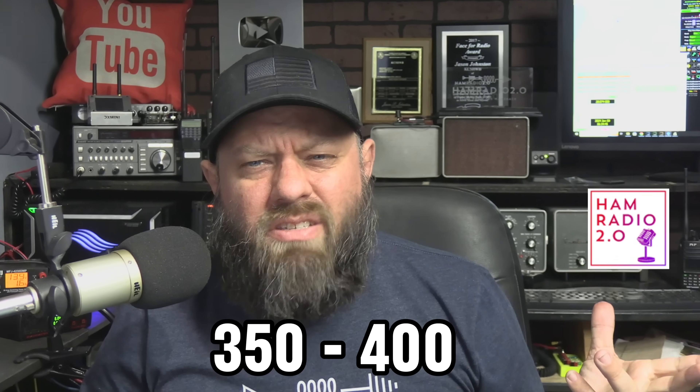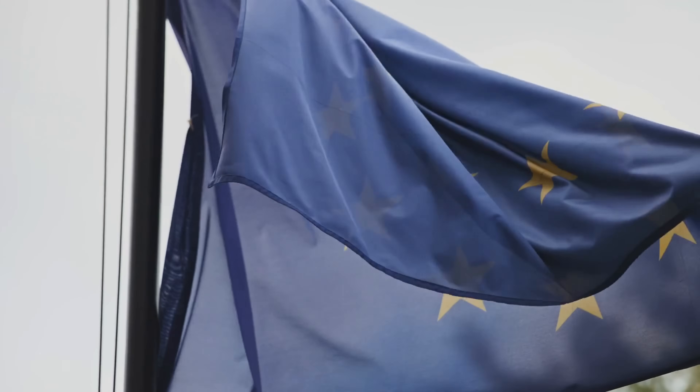I thought we were going to see splatter everywhere on 220 because it's not advertised on Amazon as a 220 radio, although it is on their own website. It's also advertised to do 350 to 400 - that's a band used overseas in Europe. In the USA, 350 to 400 MHz is mostly commercial and military stuff. There might be some older wireless guitar transceiver kits around 360-370 MHz, but in the United States it's kind of worthless as a voice frequency.